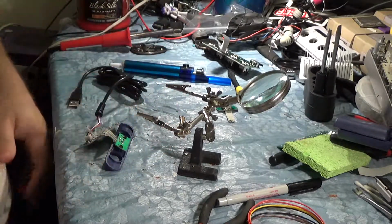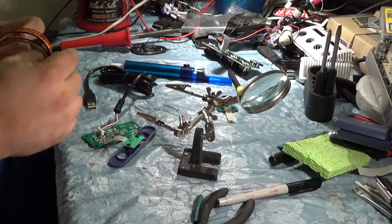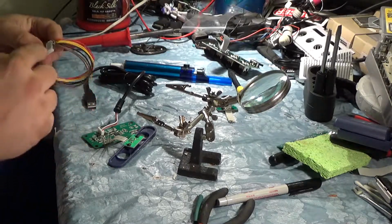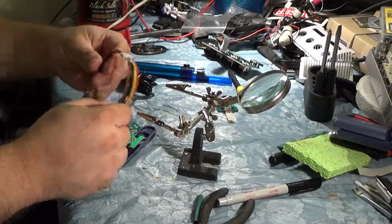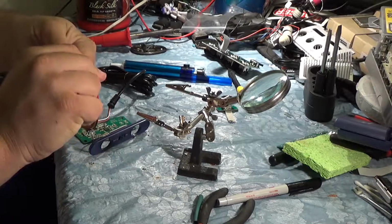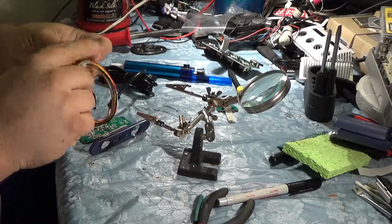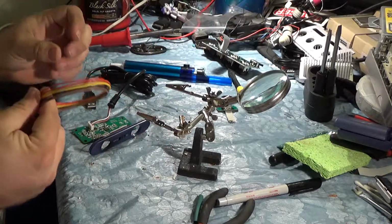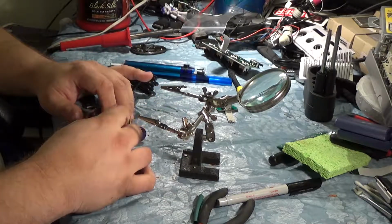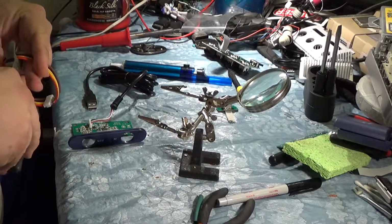So, yay. Okay, I don't remember if I actually said what I was doing with this earlier, because I haven't watched this footage since I shot it a few days ago. What we're doing here is making an adapter in the middle. We want to run these wires out these ports to a breakpoint that we can plug back into the other side to go to the front, so we can disassemble this more easily. So we need to make sure we have enough wire to get out of these ports and then back together. We'll just do it in half before I change my mind.